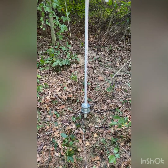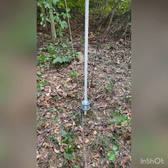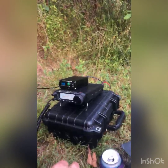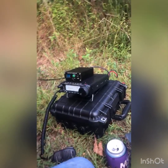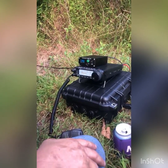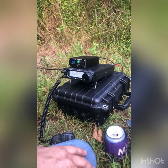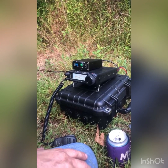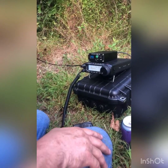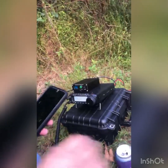25 bucks built the antenna. I did have a spool of wire which saved a lot of money because there's quite a bit of money in the copper for the radials. Nonetheless, it's a performer — it works well. We just got done checking the SWR without a tuner, just using the tuner to tell us the actual numbers. On 40 meters right dead in the middle of the general band we were at 1.3, and in the middle of the general portion of the 20 meter band we were at 1.4. It tunes down very easily to 1.1 to 1, so it's electrically perfect.